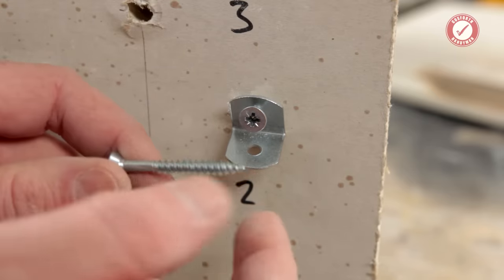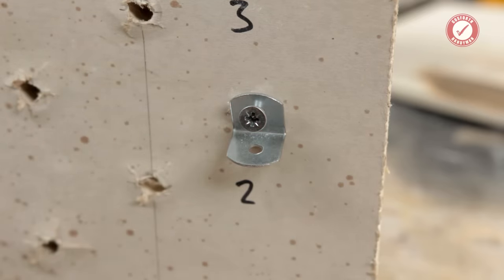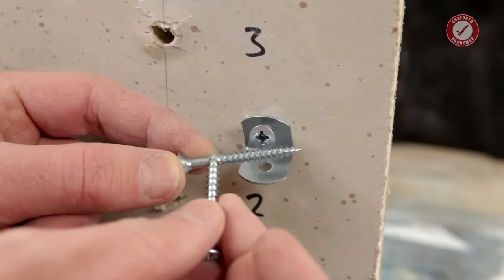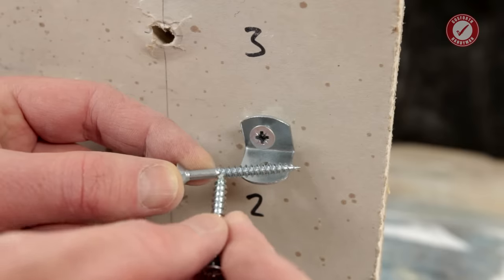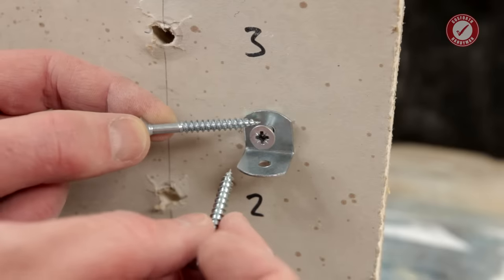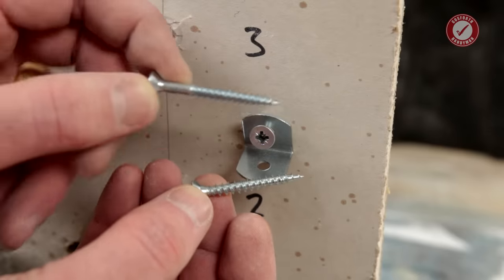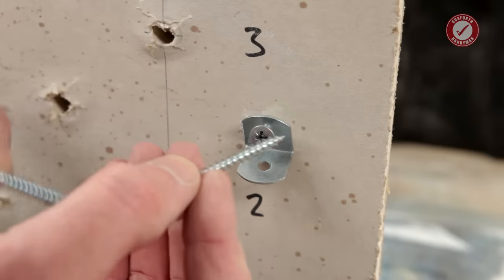Purely out of my own nosiness, I've tried it with a Quicksilver screw where we don't have the thread going all the way to the end — and right enough, it's gone horribly wrong. The fitting's just spinning round. So I think that proves it pretty well: you don't want to be using screws that have got an unthreaded portion towards the head. That's fine if you're putting up battening where that part never enters the plug, but for something like a thin bracket — a mirror bracket or similar — you're really going to want a fully threaded screw. It does tell you in the instructions that you should be using a fully threaded screw, and that is why.